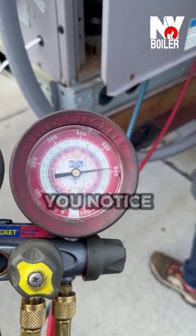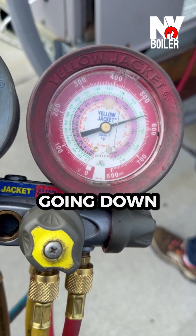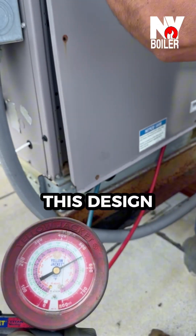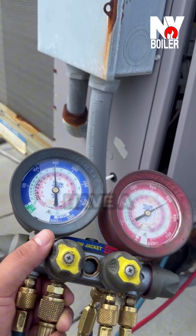Right now the head pressure is to the roof, but you notice as you push the door in the pressure is going down. I personally don't like this design because on the other rooftop units you can take the pressures from outside — they actually have a port outside.